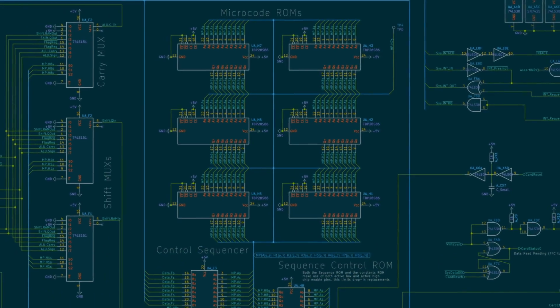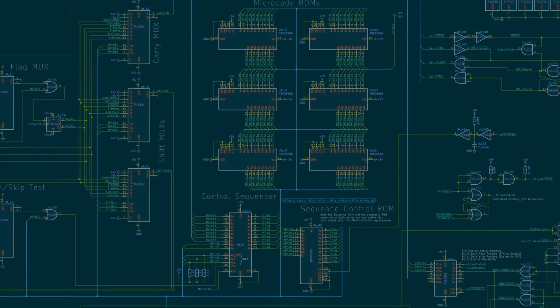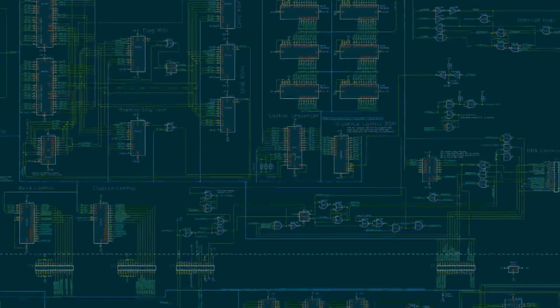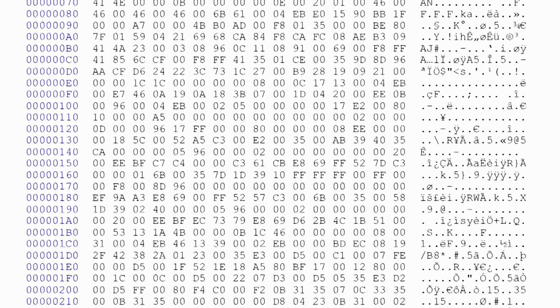Not only is it very difficult to wrap your head around, you absolutely have to have a schematic. But thankfully, Meisaka is an absolute legend and she reverse engineered a full schematic for the FFC, and that's where Gecko and SJ Software has been spending his time lately, looking at and understanding the microcode. He says that when it's in the read test, it's kind of just stuck in this loop looking for the composite data coming from the floppy drive. And even after it says busy did not clear, it stays in this loop.